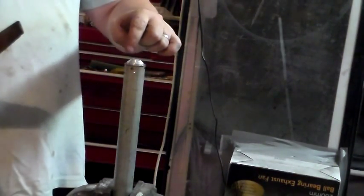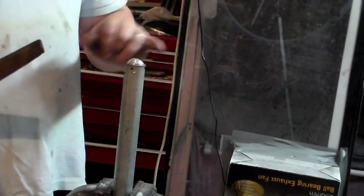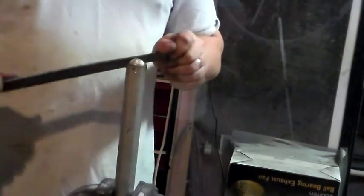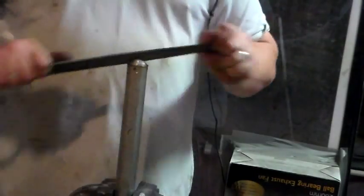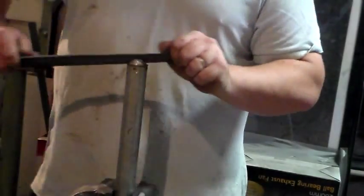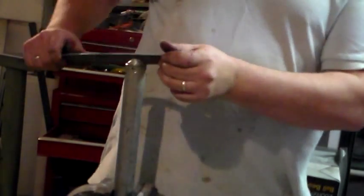One of my concerns at this point — obviously not having any experience with plastic injection moulders — is that if we don't have a smooth even surface around this tip to match up to the same shape on the actual metal mould, then under pressure you'll get too much leakage. Maybe I'll have to put a rubber seal in between the side. But they're in there pretty tight, and that's not coming out. It's sealed those holes off.